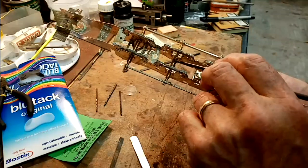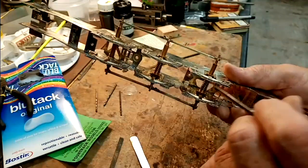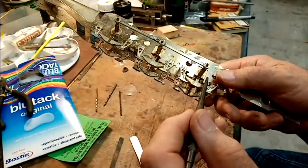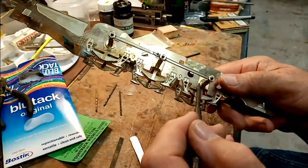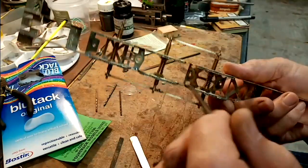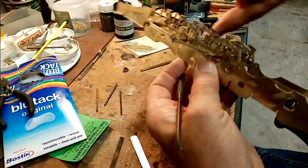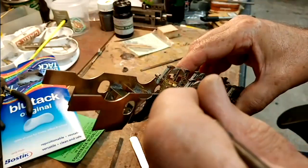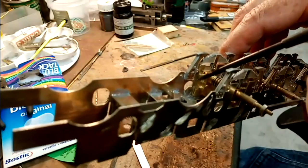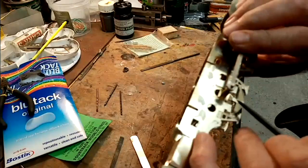These chassis alignment tools are readily bought. I've had to cut the springs in half because they're just too strong otherwise. They're designed to hold the full axle boxes pressed out against the frames, and the actual unit will float about within that area there. So I've put the fixed axle in now, and these two are set up, and I'm using the coupling rods to align the axle boxes. It's very difficult to see, but the web I've lined up with the mark in the chassis, and looking down them, I've got them pretty much vertical now, and they're ready for soldering in place.